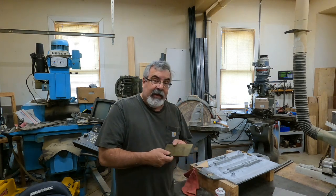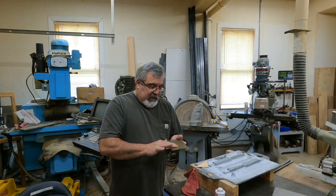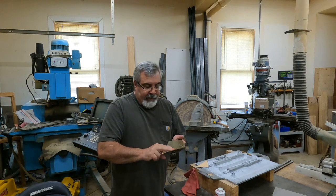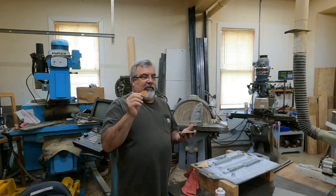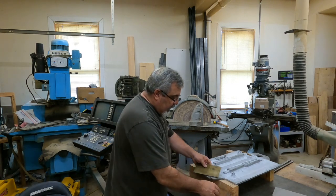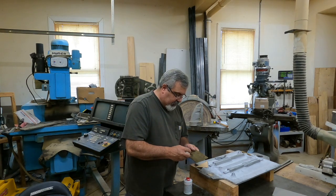So I did find a piece of 1/8 inch brass stock, okay? You can clean it up a little bit. This has been sitting for years and years. I don't know how long. Just take a piece of emery. It's traditional. Whenever you do metal work, you usually use emery. I've got so much woodworking sandpaper laying around, I'll just grab a piece of that. I do have some emery too. But all right, get some Dykem, paint it up.